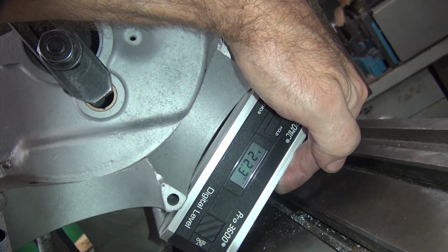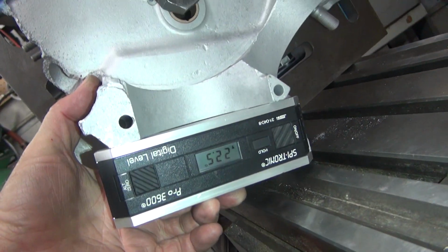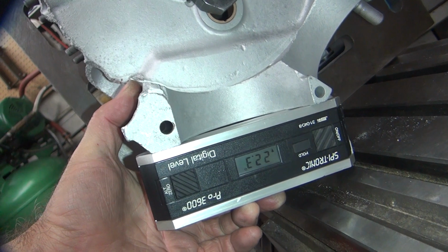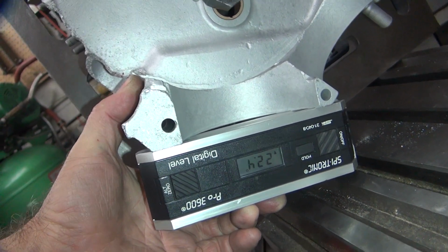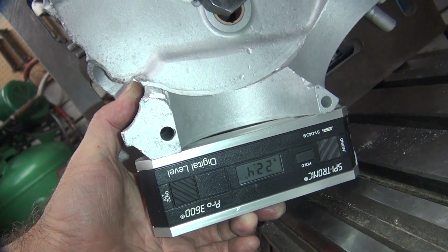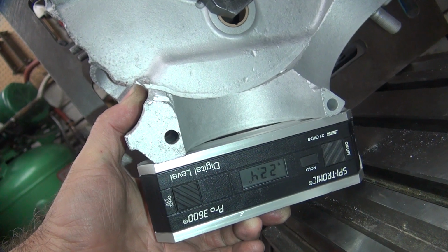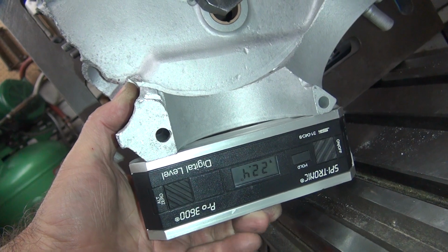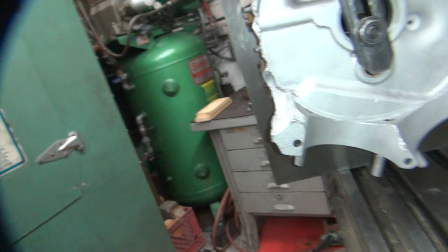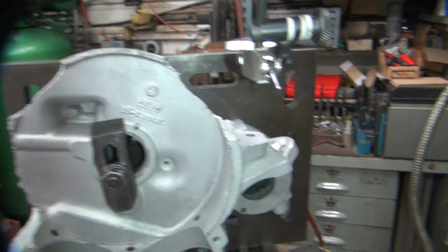22.3, and it looks like it's a high 3 because it was all the way up to 4. Let's see what this one says. Looks like it's a high also because it's a 22.45. Looks like this one wants to be at 4 instead of 3. Alright, close enough. We're less than 0.1 degree off.